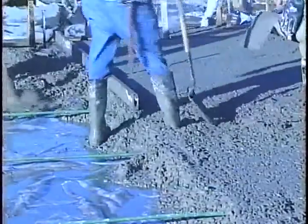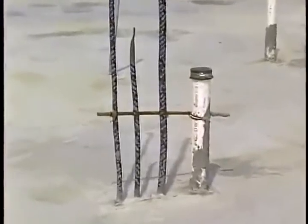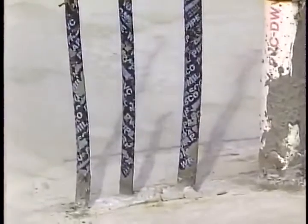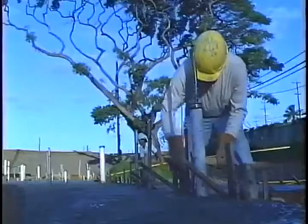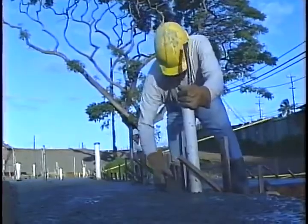Well, specifically for our water lines, we are required by the contract to sleeve the water line. However, when it does angle up and come through the concrete slab, we use a polyethylene adhesive-backed pipe wrap to make sure that there is not a pathway for termites to get through the basaltic barrier once we finish the concrete placement. For other types of pipe penetration, such as waste lines, the concrete and the pipes do form a good bond without any pathway for termites to get through the BTB.